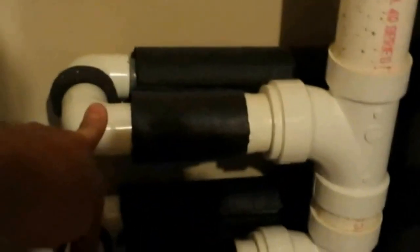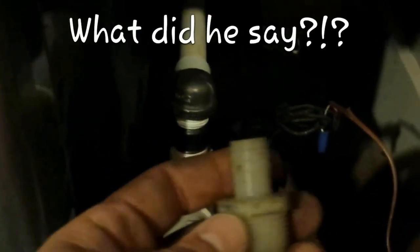You've got your water in and water out. The problem was the condensate drain tied in down here. They have water out from the three-ton unit and water out from the five-ton unit, and they had their condensate drain tied into the same line. One at a time — fine, no problem. But when both of them come on, you can see water's been running across the floor. This has been happening since I put it in a few years back.